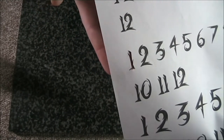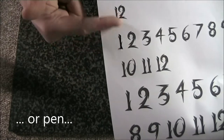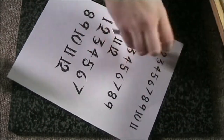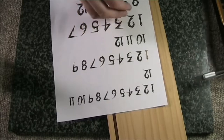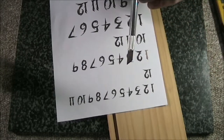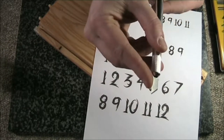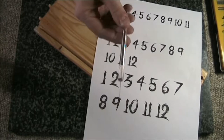Using the exacto knife, I've been able to cut out the number one. Later on we're going to put that over the steel using a soft pencil to mark it so we know where we're going to be etching. One thing I should mention: get a bit of wood or failing that an old magazine to rest the paper on as you cut. If you do it directly onto granite or metal you will blunt the knife, meaning you'll spend half your time replacing or sharpening blades. I've already blunted this one at the tip, so I'll have to replace the blade — so bear that in mind.